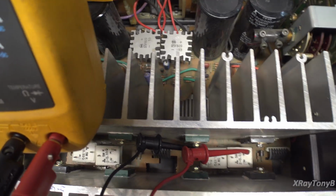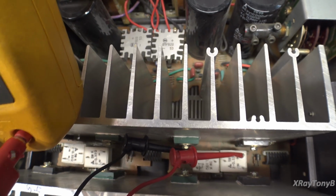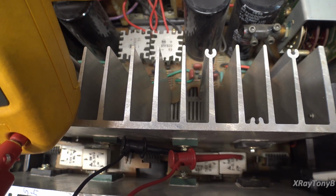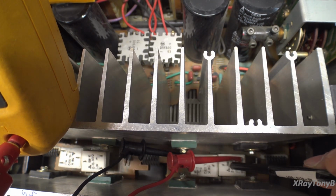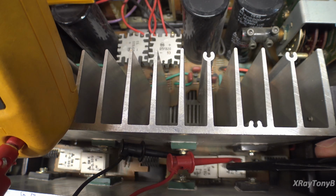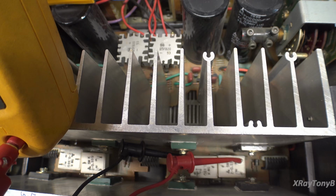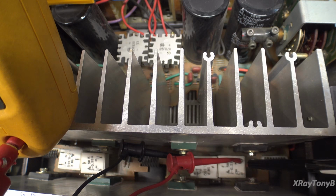And you can see, by the way, here's your 4 emitter resistor sets. So there's 2 resistors inside each one of these packages. And so there's 2 for this side and 2 for this side, and they're just sharing the same housing. They're special resistors, and they have the leads protrude up through the top of the body of the resistor to make convenient little test points. So you see we're hooked onto those. So we're just actually hooked on to those 2 resistors in series.